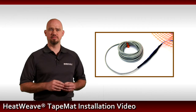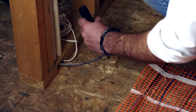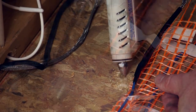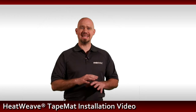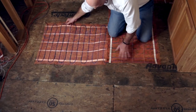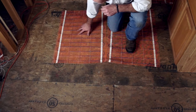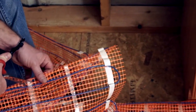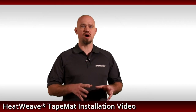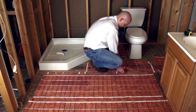A factory splice connects the cold lead to the mat. It is important not to bend this connection. Depending upon the thickness of the mortar used, it may be necessary to chisel out a portion of the subfloor to recess the factory connection. The mat can be manipulated to fit any type of area using a combination of rollovers and turns, including the 90 degree flip turn and the 180 degree back to back turn. The wire can also be removed from the mesh entirely to cover odd-shaped areas using a fill-in technique. The outside runs of tape securing the wire to the mesh are peel and stick. Once the mat is placed in its final position, remove the backing and secure to the floor.